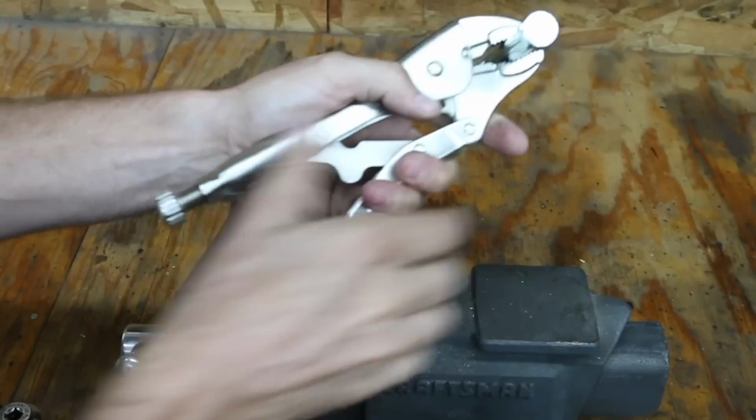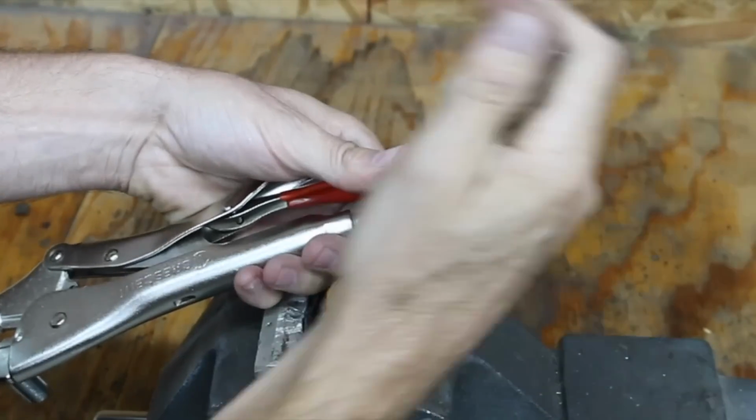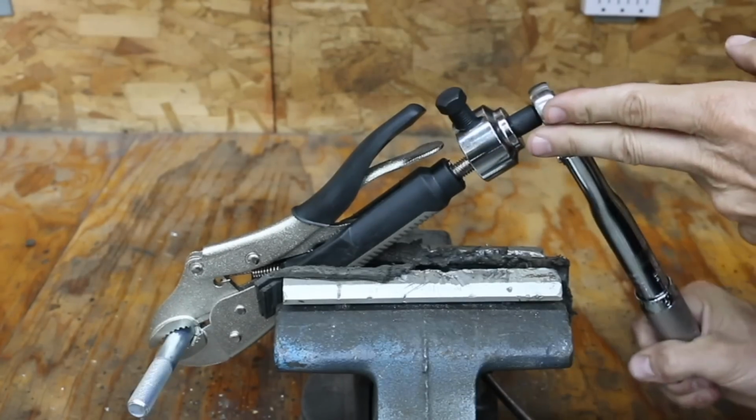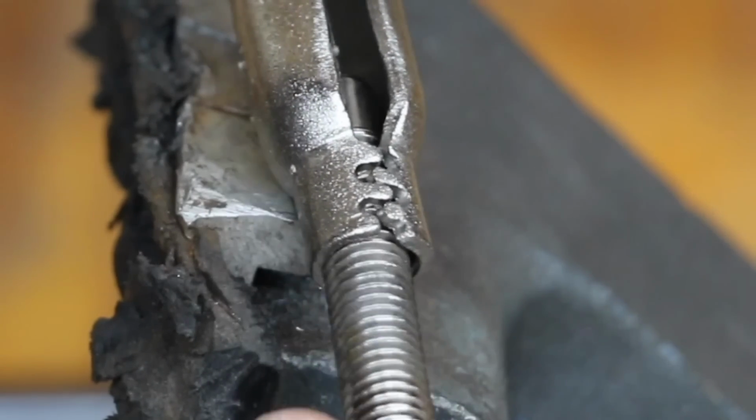locking pliers. In the first test, I clamped the locking pliers onto a smooth portion of a grade 5 bolt. I then used a rounded nut extractor to fasten to the tension screw. The adjustment screws were tightened to 120 inch-pounds. Unfortunately, not all the brands could handle 120 inch-pounds of torque on the tension screw.